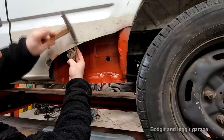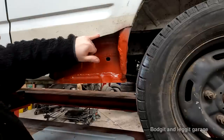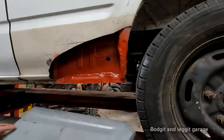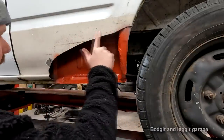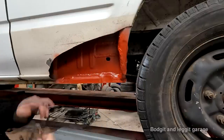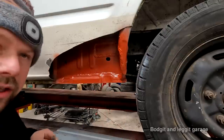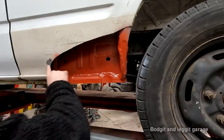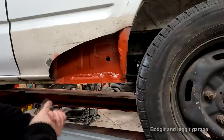Right? I'm going to joggle this panel, not joggle this panel. That's the key. Joggle the panel you've got on your vehicle. That's why you do a nice kind of arc like this, and it's easy to joggle the panel. On the other side, I did step joints, which I still prove you can joggle a panel like that, but this is just easier. So I'm going to joggle this panel, and I'm going to do my step joint, which is going to make things a lot easier, as you'll see.